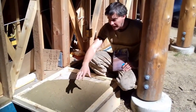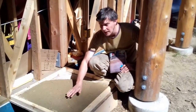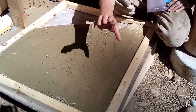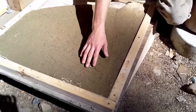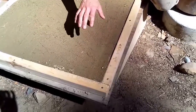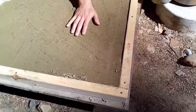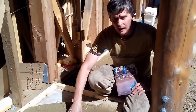To prevent or minimize cracking, in this mix we've gone two sand to one of the native clay soil material and a half a bucket of straw. So I've increased both the fiber and the sand, and you're seeing almost no cracking. The crack along the side of the frame is tiny — probably less than a quarter of what the 1.5 sand mix showed. Definitely the higher sand mix is going to reduce cracking.